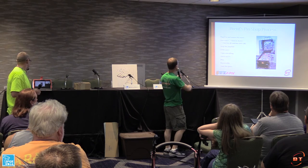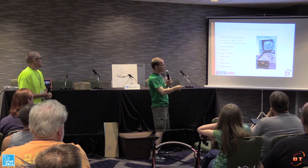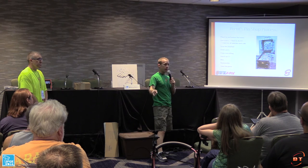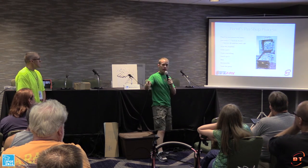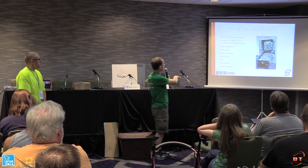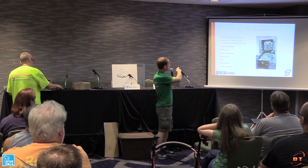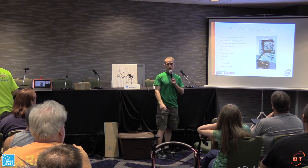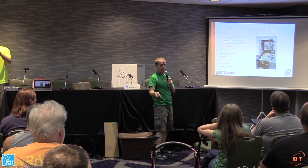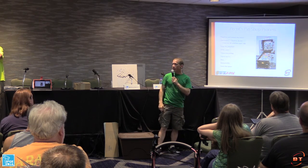All right, so here's my basic process for shopping a pin. I'm going to plug it in and assess the basic issues. I'm going to do an electronics check. And if I find something, I'm going to go ahead and fix it. As part of that, I'm going to exercise all the switches and coils. I'm going to strip the playfield, order parts, and then while the parts are coming, that's when I clean. And honestly, that is where, on average, you're going to spend the majority of your time, is cleaning. Touch-up, if you feel so inclined, and we'll talk a little bit about that. Wax it, reassemble it, and then finally tune the game.